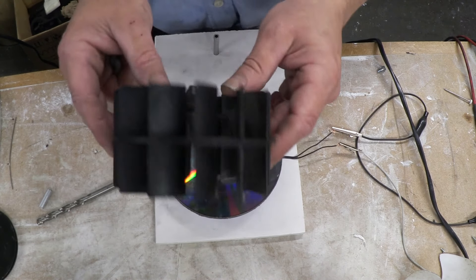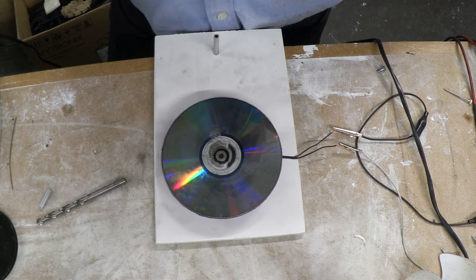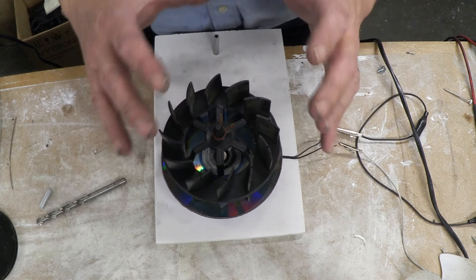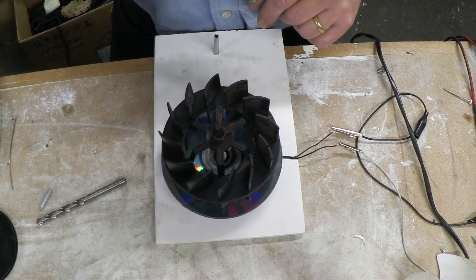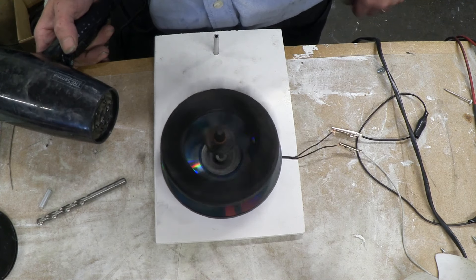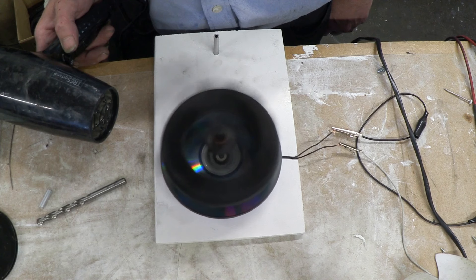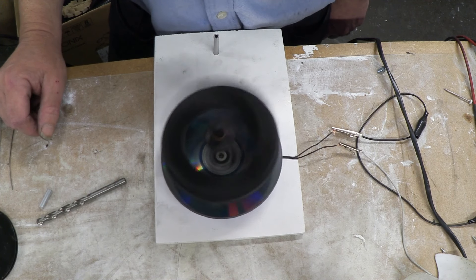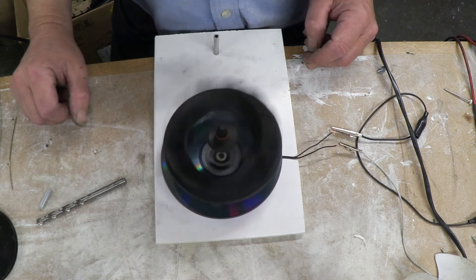Here's one I really quite like — this is a squirrel cage design, and I took this from a normal motor. It works actually quite well; it's kind of very similar to the Savonius type if you think about it. This is what you see very often in vertical designs. If we put two flywheels top and bottom we get double the output on this. That gave me about 73 milliamps, which is really very cool. You can see it continuing to spin for quite a long time — that's because of the flywheel.